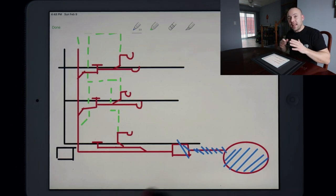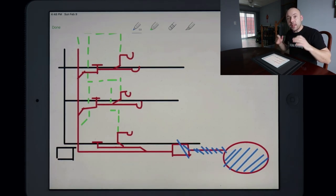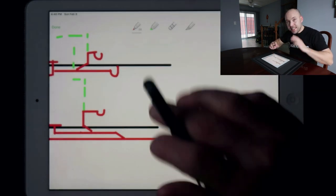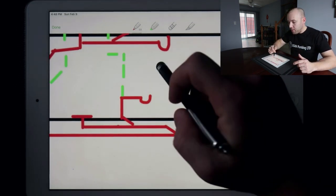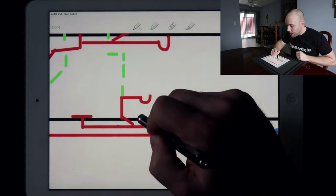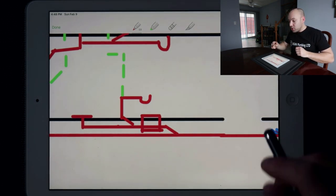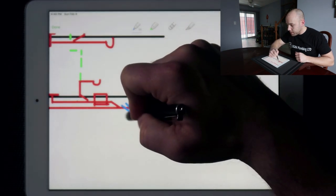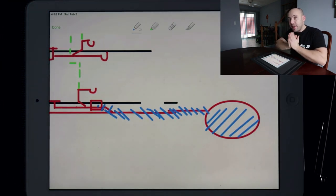So because of the mess that can occur if you install it on a main line for a multiple dwelling unit, what you have to do instead is completely take it off of the main and simply protect just the basement. And this is how you would protect it. So in the basement here, I've roughed in a powder room. So instead of putting it where it was before, we would then opt to put it on the branch inside the basement, so that once the water starts filling up from the street, as soon as it hits that branch, it gets stopped by the backwater valve.